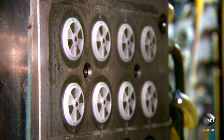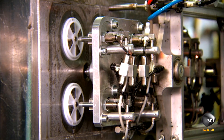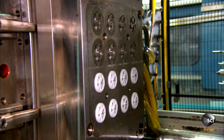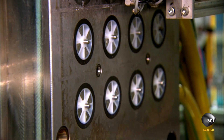Next, they mold wheels from nylon. A robot transfers the wheels to another part of the mold. The mold closes, and a nozzle pipes in hot liquid rubber to apply it to the rolling surface of the wheels. The rubber adheres to the nylon and solidifies.